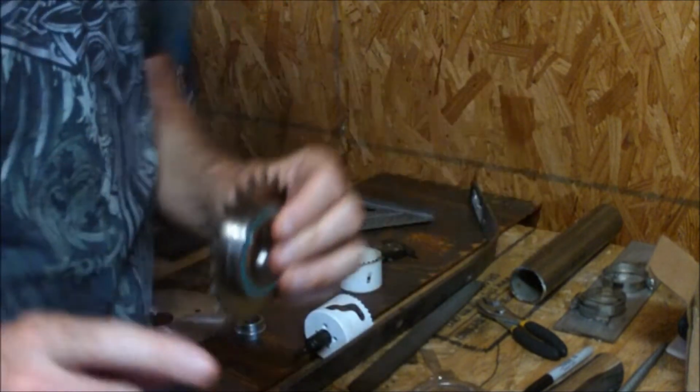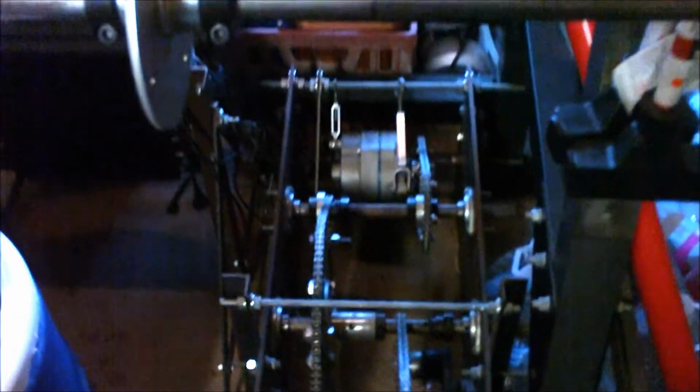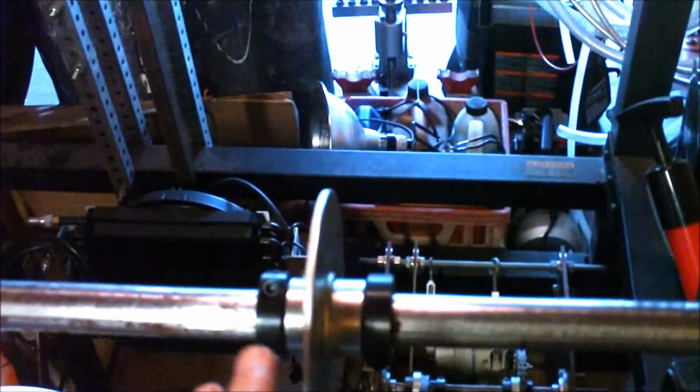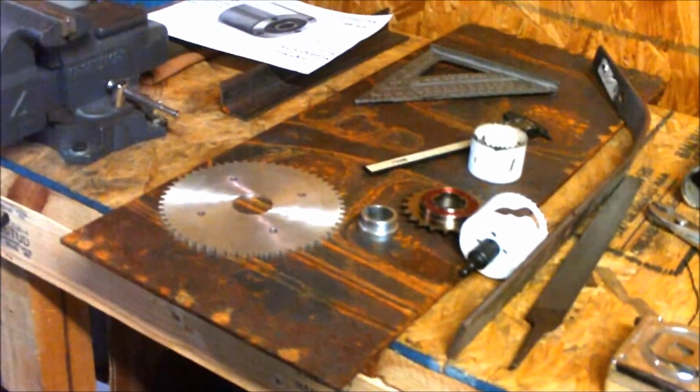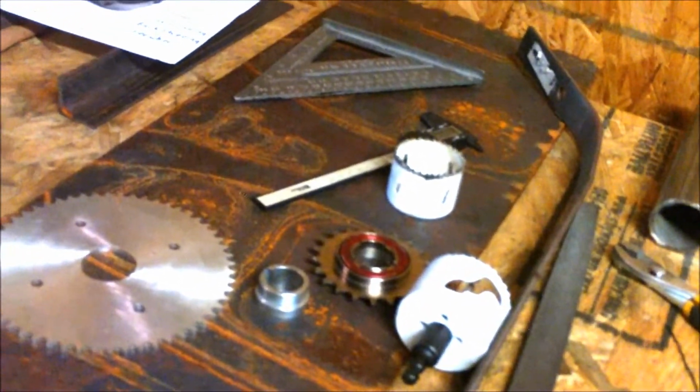And we're going to need this Freewheel. So that's where we're going to be putting that Freewheel, right next to that big sprocket on the left here, on the left side of the gearbox. In the last video I said I was going to put it up here, right there on this transfer shaft, but I was wrong. We're going to put it down here instead, right next to this big sprocket. That's going to work out really well for us. The Freewheel is going to turn right there on the gearbox on the first axle, and we should have pretty good success with that. That way the Freewheel is going to let us wind the weight back up in reverse without having to turn the entire gearbox in the process, which would be almost impossible.